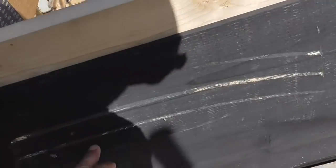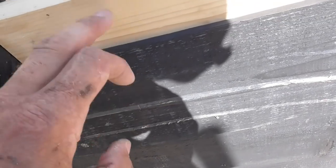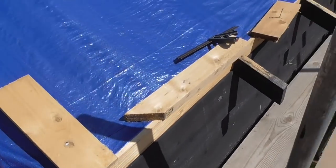Now what I can do is measure up my gauging up here and then just take a measurement from here to here and rip these last bits down and fix them in, bring them up flush with the top like I did the other side, and that's that ready for the ply then.